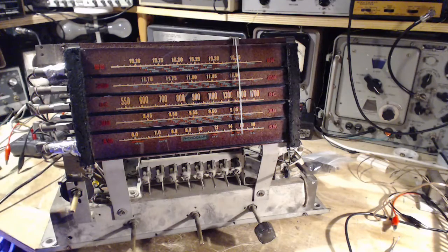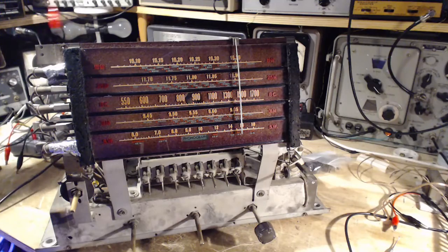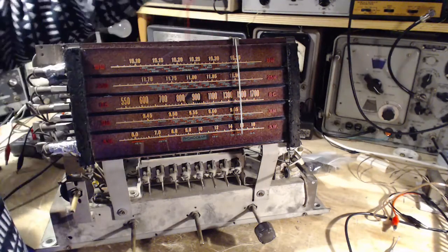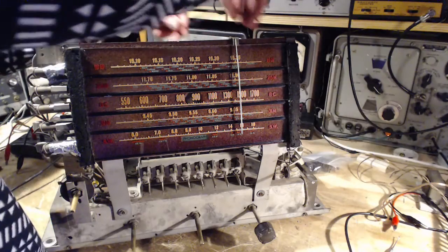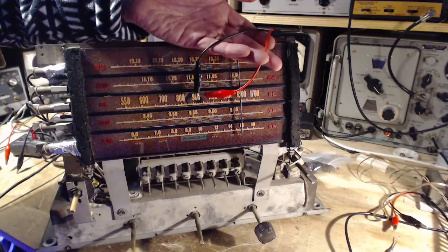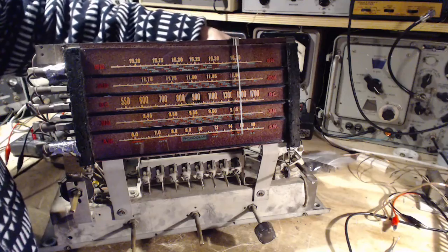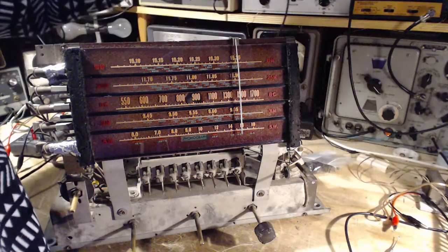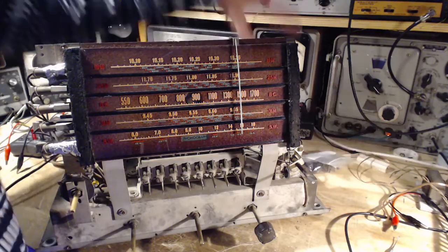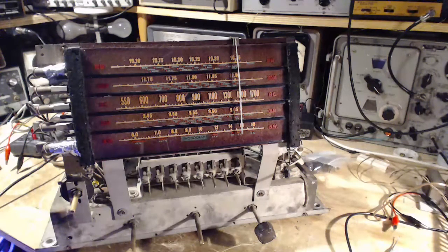It's a radio. It does not detect signals the same way that one of these guys does. It's a totally different thing, just using computer cleverness. So this amounts to the antenna to that radio, and that radio is going to put something on the screen here shortly for you to look at. And all I'm doing is just throwing this as a loop kind of in the back of the radio here, where I imagine the local oscillator signal is floating around and can be picked up quite easily.